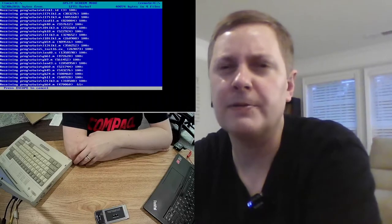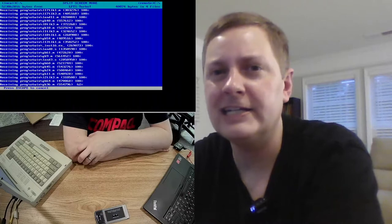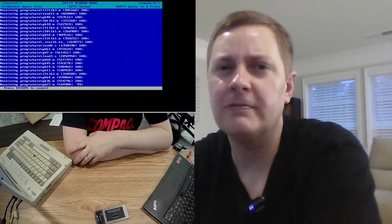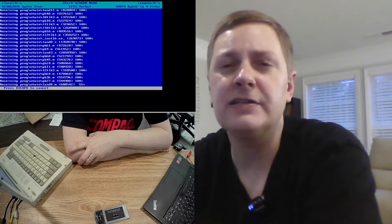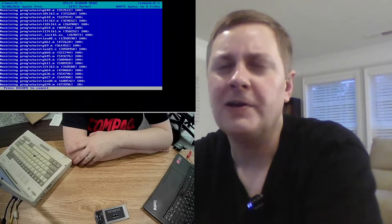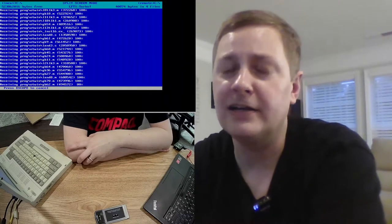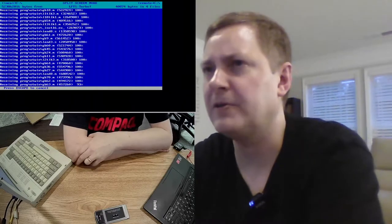I haven't ever worked with fiber. I've worked with 10Base2, where you have the nice BNC connectors that you connect together and have to terminate with T's, and then I guess the baseband, and then most of it's just been RJ45. For a lab or a room full of PCs, I really like the concept of 10Base2, in that you're passing everything through the same cable. Whereas with RJ45, you have to run a cable from every central point. It kind of felt like a downgrade, but I get it. I guess that architecture is better in the end, how that works out.